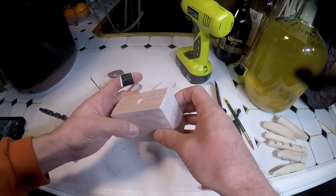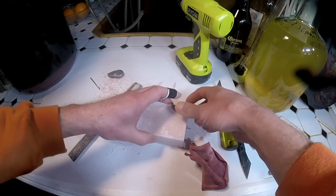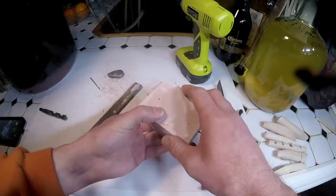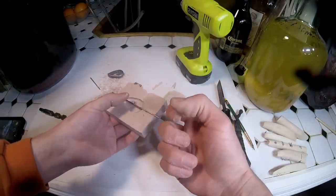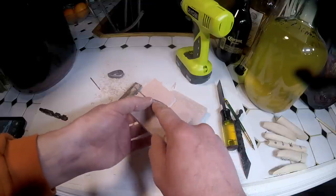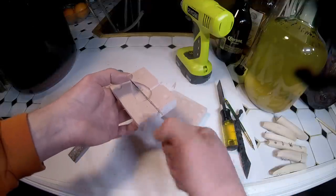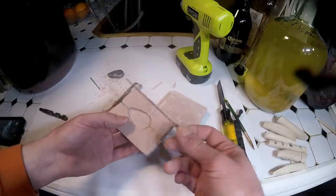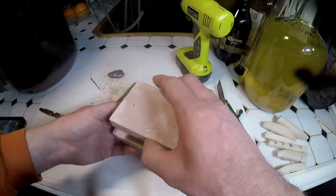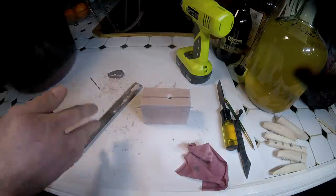Hell yeah, looks good. Like I was saying, this rod's going to be set into one side. We'll pour the lead, let it solidify for a few minutes, pop this open, and I'll make one up. It's just a T-handle on a longer rod, and then this will be sanded down so it's nice and clean. It pulls out real easy. We'll get a twist on the rod as well. But yeah, that worked beautifully. We got a 5 ounce no roll sinker mold done. Hell yeah. Be casting that and some more in a few days.